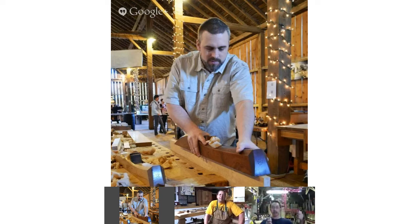Coping saw, wow, fret saw. It's a beast. And what's really cool about it is, I don't know how well this will pick up, but there are ball detents, eight of them, around the mount. So you press it in, and you can turn the mount in 22.5, or I guess 45 degree increments. You can turn it all the way around. So you can have it pointed up if you want, or at 90 degrees, or 135, or 45. I find that to be really useful.